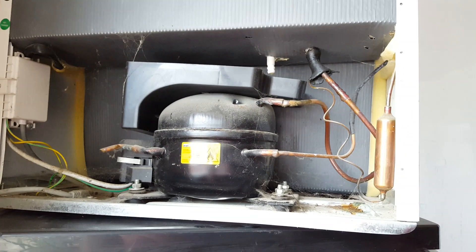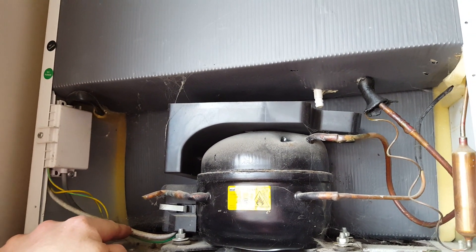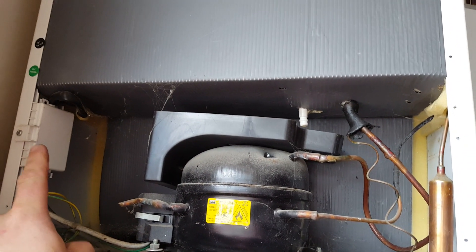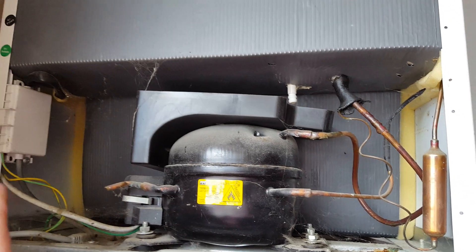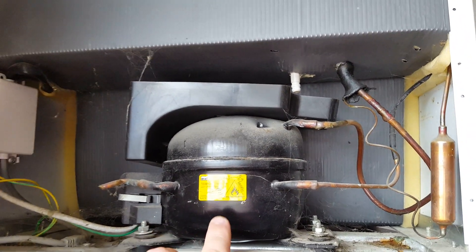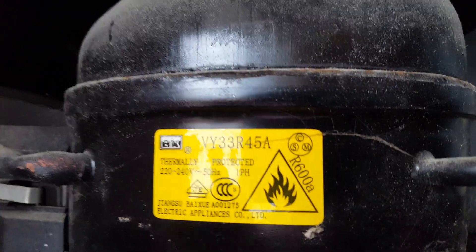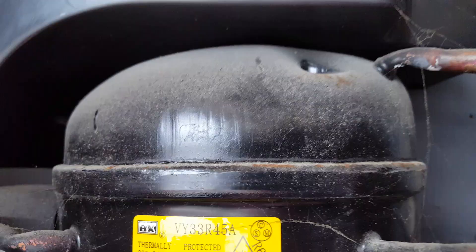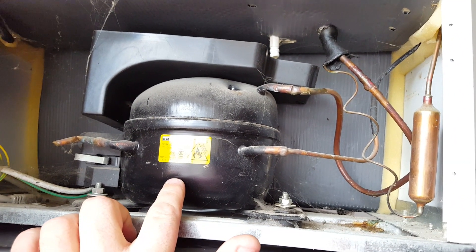So if I move this fridge — the reason I'm looking at this little fridge up in the office is because it's so basic. There's nothing to it. There's nothing in that box apart from mains cable joined together. Thermostat cable goes up and back down to give this a command to come on and off, and there's a power supply to the light bulb and that's it. So you've got a compressor, and as you can see it's charged with R600A, which is a bit of butane refrigerant — basically lighter fluid, what you find in your gas lighter to light your cigarettes with. And this little compression here is a compressor.